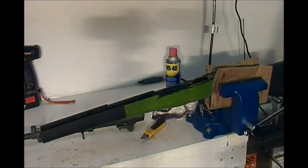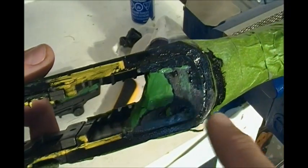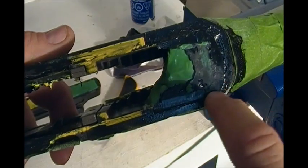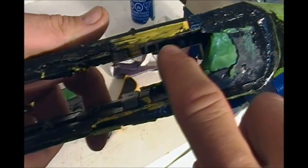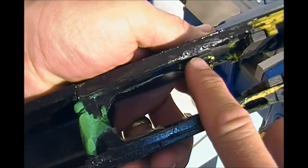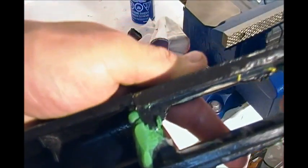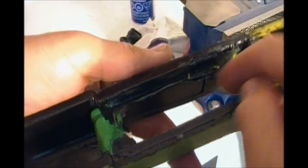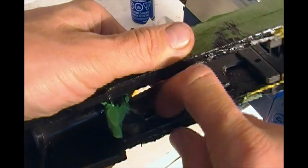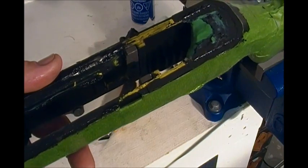It's pretty darn good. Right there you can actually see the machine marks of the metal — that's gone on really nicely. Now you've got a little bit of a void there, which is not so good — could have used a little more bedding compound, but that happens once in a while. Nice full contact along here and all the way in. We've got a little bit inside that needs to be cleaned up — we'll take a rasp and a Dremel and get in here and clean all this up. Then we'll show you the finished product.